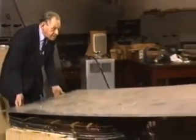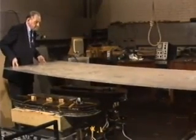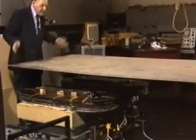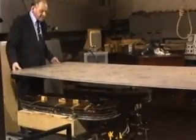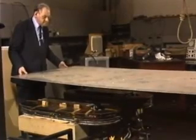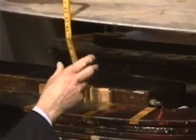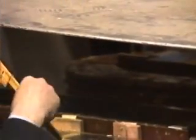Now this time we're going to do it at four hundred volts with a higher lift, and I'd like you to notice the increase in lateral stability. Switch on. Now I can practically take hands off — it's just on the point of becoming laterally stable. The supported height is eleven inches, which is halfway to our target.